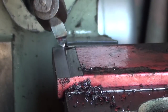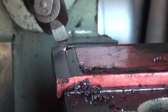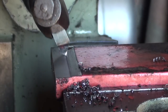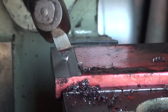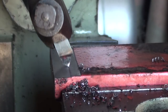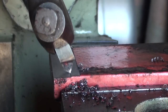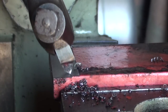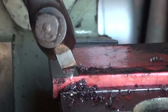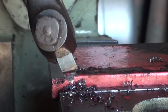Well, I made a stuff up. When I was cleaning off the top of this, I couldn't work out why the cut was getting wider when it shouldn't have been. Turns out that I didn't quite nip up the bolt that holds the tool in the tool holder, and it was slowly creeping up. Definite rookie screw up. Anyway, job's fixed now, but it had me buggered for a while what was happening. We've solved the issue and onwards and upwards.